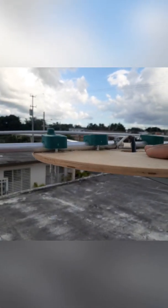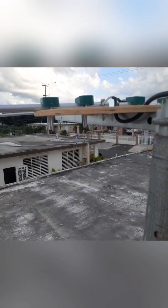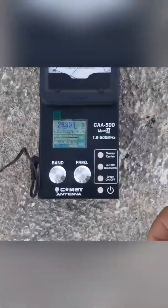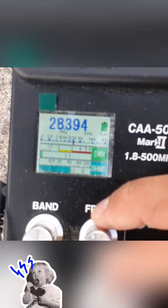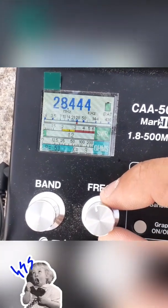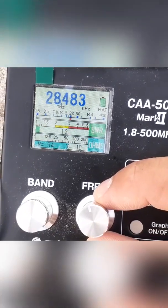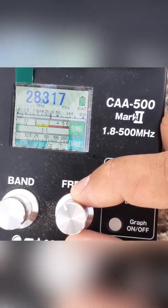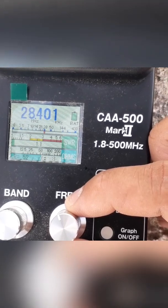Later I'm going to put the measurements up. I just cut it — see, it doesn't have anything, just this balun. I'm going to show the SWR now. The whole cable is right here. Look at this — look at the SWR on this antenna. It's only for 10 meters, so it doesn't have any gamma match at all.